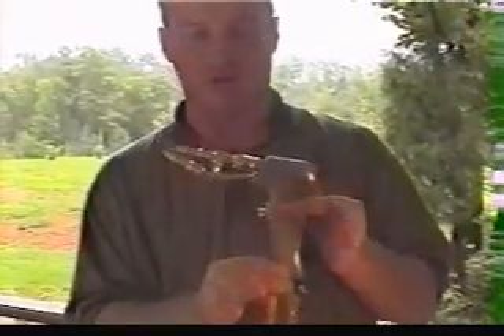Now for cutting sheet metal with the Henrob 2000. It's a little odd looking compared to your regular torch. We use two tips. The top tip will be for heating. The bottom tip is the one that actually does the cutting — when you pull the trigger, oxygen comes out the end of that.